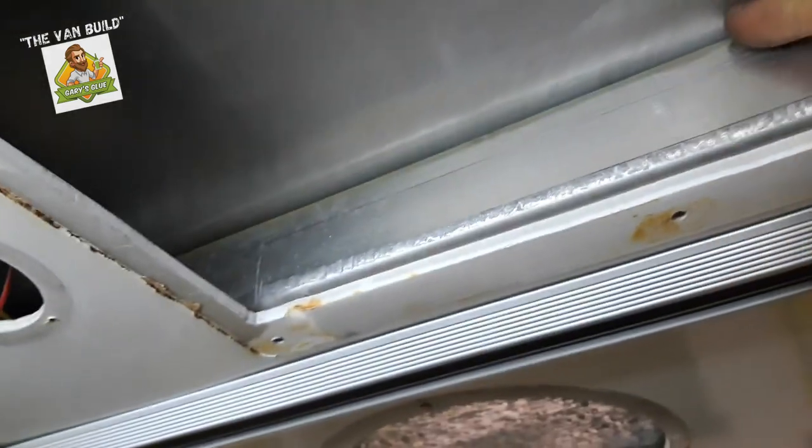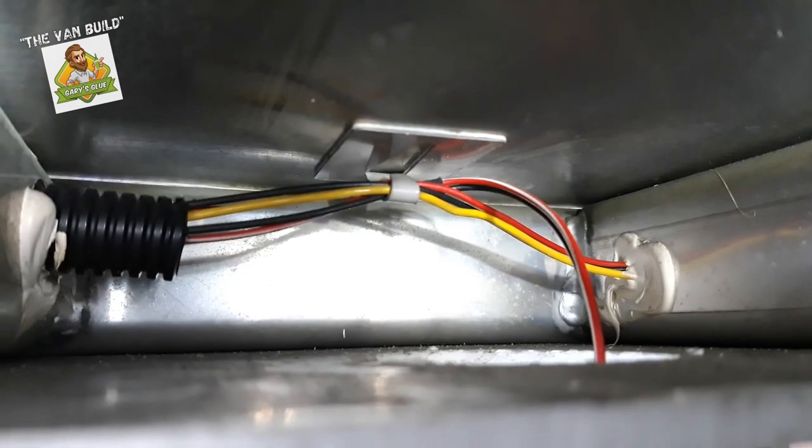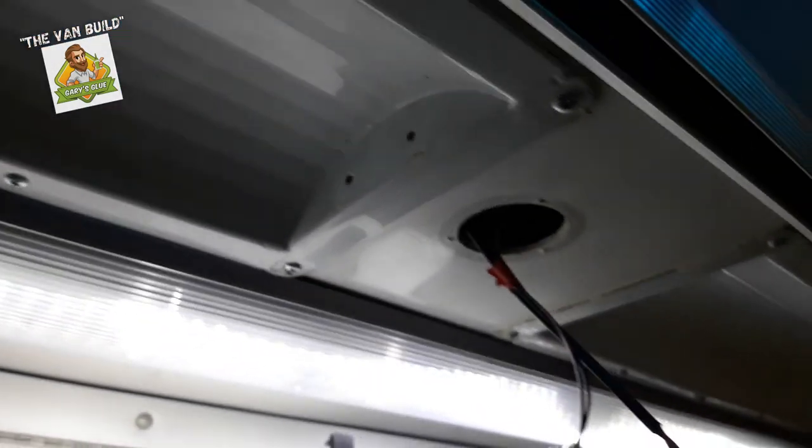There's an RSJ and it's three inches thick. I even took out this plate here to have a look, and it's the same down there — there's an RSJ there and another one just there. There is a cable going through there, so I'm going to drill a hole — I have grommets — and see if I can get a cable to come out here so I can have another pin spot just over there. Like most things it took a little longer. I had to drill a hole, fish the cable under another RSJ, and that's where the white pin spot will go. I'm thinking of just measuring that hole and getting two pin spots to slip in rather than trying to make the hole bigger.